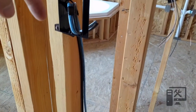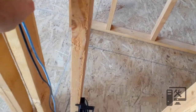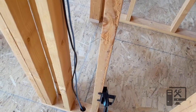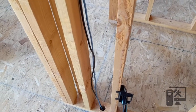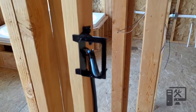Since the basement isn't being finished, I put another roll of electrical tape at the very bottom when I have the loop all the way out, and then I just shove it back into the ground. That way it's out of the way for the drywallers, and once the drywalling's done and we're terminating, we'll pull it up and leave the service loop up inside the wall where it won't be damaged.